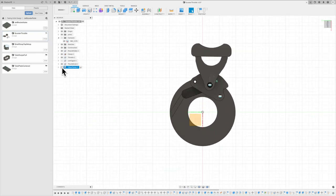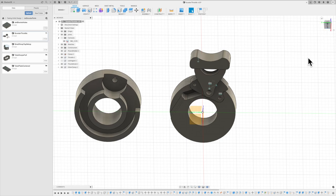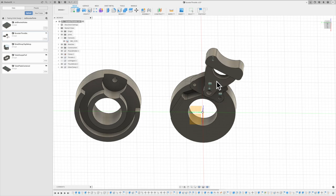And then for the last piece, made the other half where this has some additional plastic that comes out this side of that pivot that's going to go through this hole, have some clearance in here for that to move and get a sense of what that looks like. I didn't build on the rest of this plastic here, so that I didn't include in the model, but that is going to go through that hole. And again, I just used the picture. I used the center of that potentiometer to determine where to put this hole on this side and to line all that up. And this slot is going to be a spring groove where the return spring is going to run to be able to bring this back when you're at low throttle.